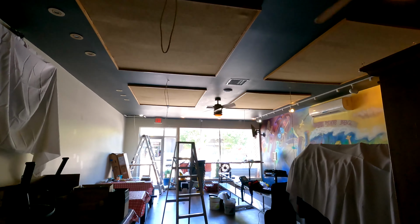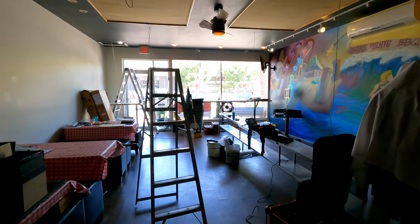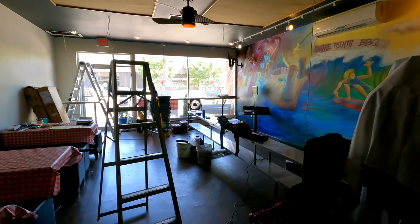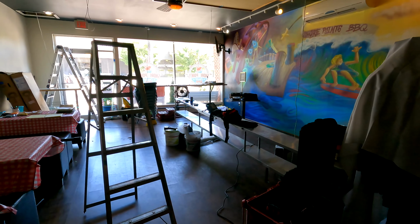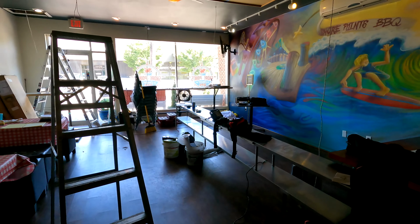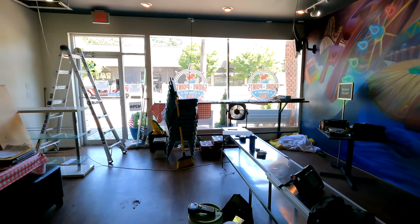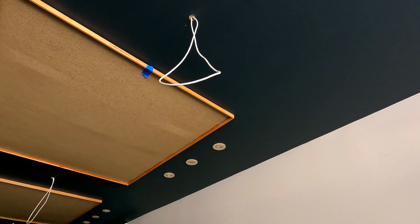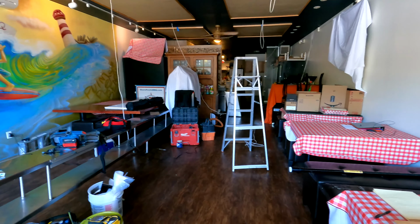It's really nice. I like to go with enough speakers so that you can cover the space with sound and not have to turn up the volume too much. For this room, 6 speakers is perfect, but you want to have enough speakers so that you don't have to crank the volume for everyone to hear it. That's one of the concepts behind providing good audio for a working space like this: have a good spread on the speakers, good distance between them, but also enough speakers so that you don't have to blast it so everyone can hear it. Everyone wants to hear the audio, but it should be at a moderate level. It should be part of the ambient noise floor, not overpowering conversation, you know?